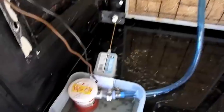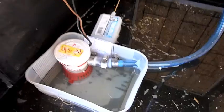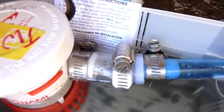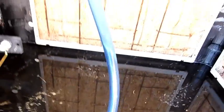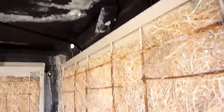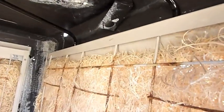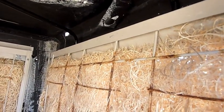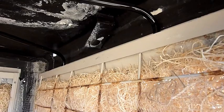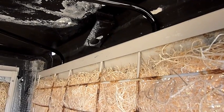Here's the DC pump I got — it's a 500 gallon-per-hour Tsunami 12-volt pump. I adapted it down to the half-inch tubing that the spider tubing uses. Normally this unit had just one arm per pad, but I put two arms per pad for more flow. Since this DC pump is slightly more powerful than the original AC pump at 400 gallons per hour, it can handle it fine. I've sort of overclocked the pads, which makes them wetter, colder, and really frosty when I stand in front of it.